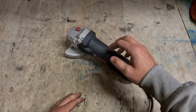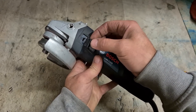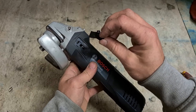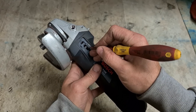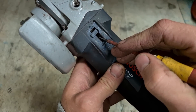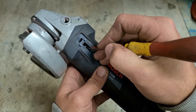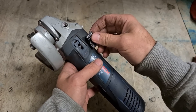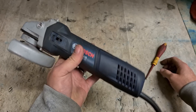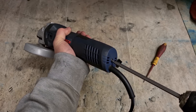It's quite a simple repair, but it's a bit of a torture. Sadly, it's not just a case of pushing the switch onto the plastic housing. It also has to click into a lever underneath, and that lever is just floating there. So if you push it in, it's just going to move out of the way and not engage. We have to push that lever onto the switch from the inside, which means you have to strip it down. A lot of work for a tiny piece.